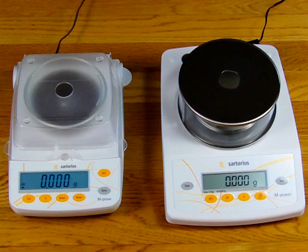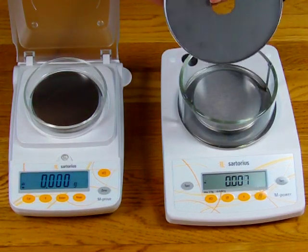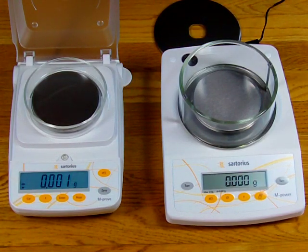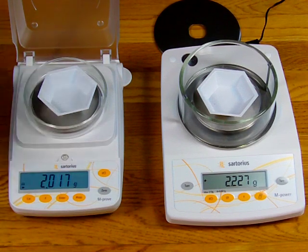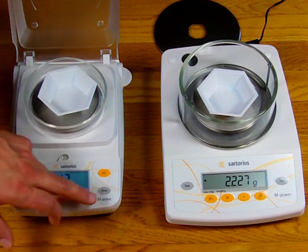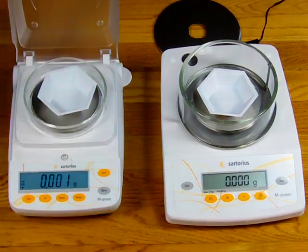In my demonstration today I'm going to open up both lids. On the AY we have a cover, and on the AZ we have a nice stainless steel lid — I'll just remove it. I have two weigh dishes; these are anti-static weigh dishes and I'm going to place them on the balance — both the exact same models. I'm going to wait for the scale to be stable, then press the zero/tare key on the AY, and on the AZ I'll press the tare key so they're both tared out.